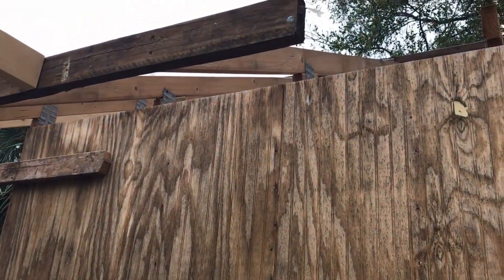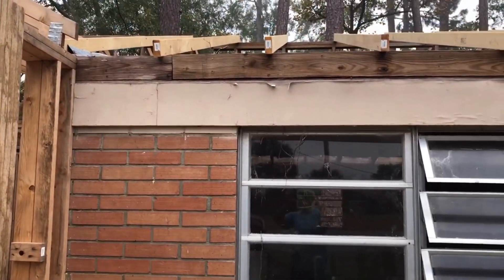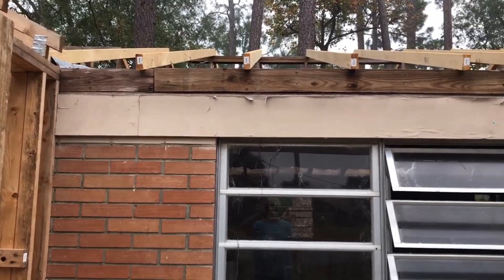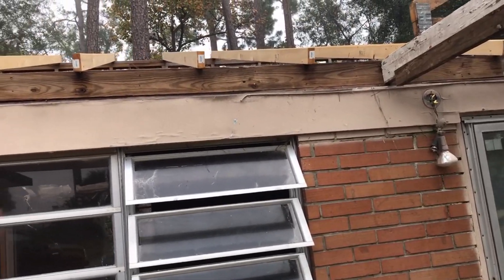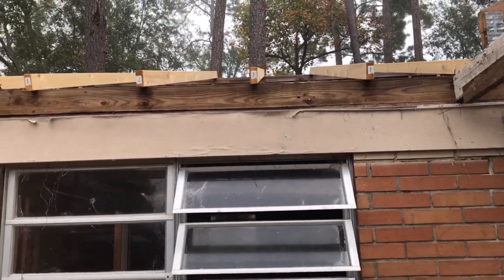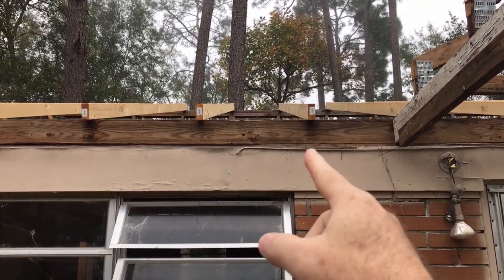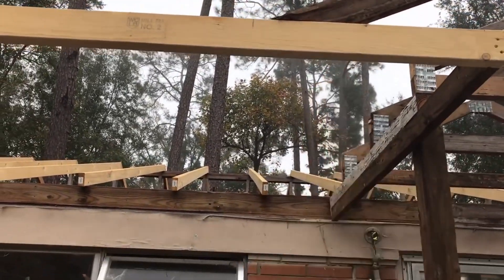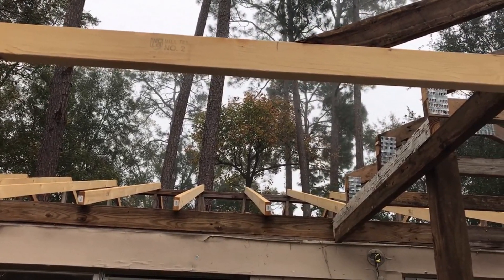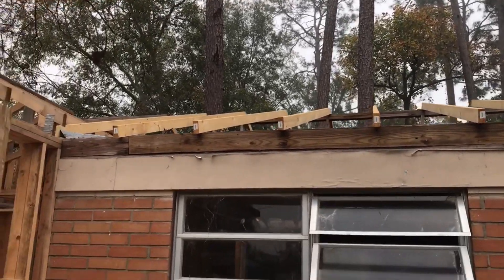While that's going to be a lot of extra lumber — and here I am complaining about the cost of lumber — I want to make it look nice. That's just a thing I like to do. So then we're going to have to come back and run our two by four rafters on top of the wall there, back and tie them in to our two by fours out here, and that'll give us our shed roof over our front porch.